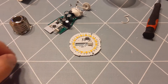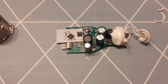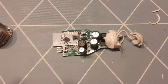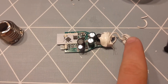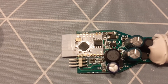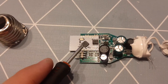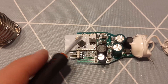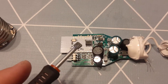The top part is only the LED part. I'm only guessing, but I think that the green part is the power unit which transforms the voltage from 230 volts in this case into something usable for the ESP unit. This is some kind of ESP chip — the ESP module is here in the middle. Here is the ESP; it is a flash module according to its description found on the web.